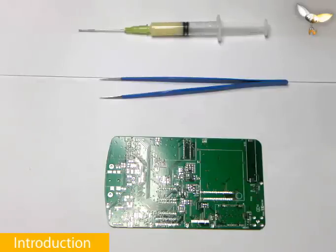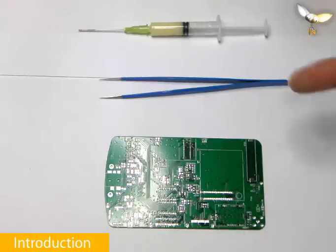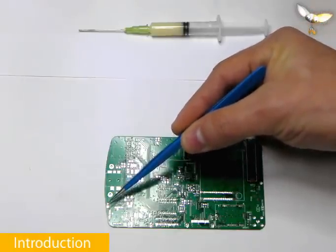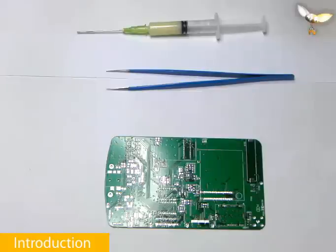As you will see in front of you, there are some things which we are going to need. This is the actual PCB, some tweezers, some flux. We are going to be using two different kinds of solders here, and soldering irons. One is going to be this tip here, which we are going to use most of the time. And the other one is this one here, which is a bit bigger. We use the second one for pads which are on the polygonal plane, and they need a bit more temperature for soldering components onto them.